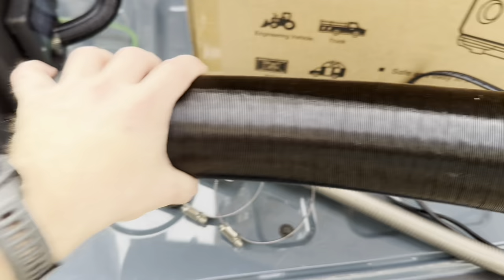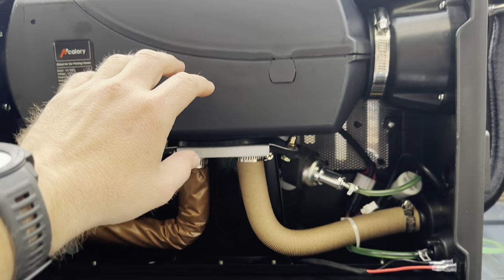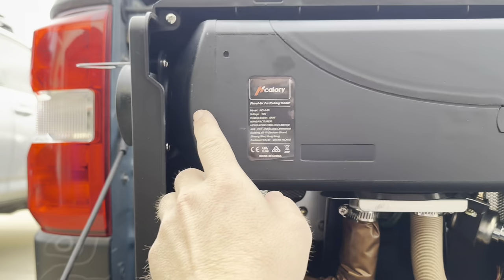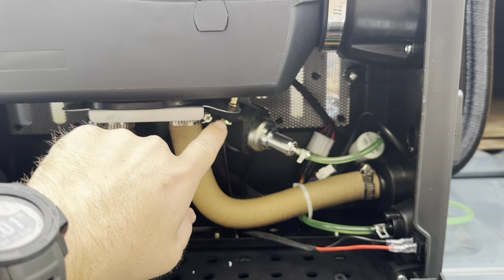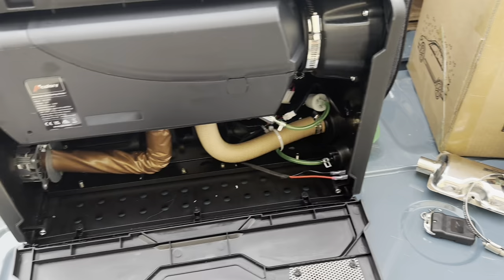This is the unit – it's the size of a little briefcase. Inside you've got your actual air heater, your exhaust hose right here, the exhaust line going out. Clean air comes in, gets heated up right here, and gets shot out through there. There's a green fuel line – diesel fuel comes in, goes to a little inline filter, there's a little fuel pump inside, and then it ignites and creates heat.